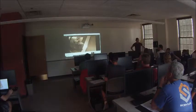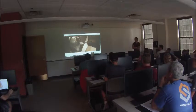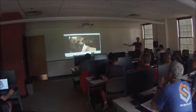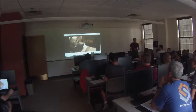So basically, this is that rotating piece with the chuck on, it's called the spindle. What happens is the spindle can position precisely on some lathes. And then basically, that's a milling cutter, right? That bit that just came in, it's milling, right? So this is a lathe that's turning, but this lathe can also do milling, right?